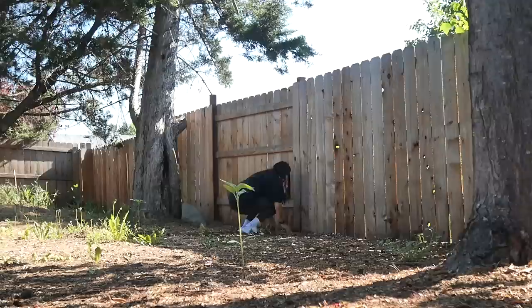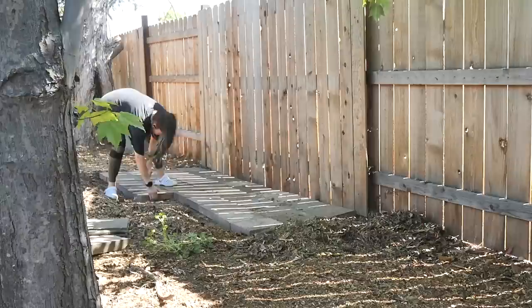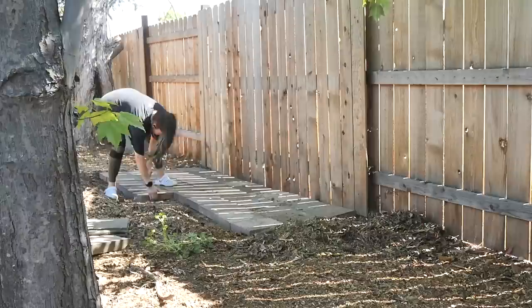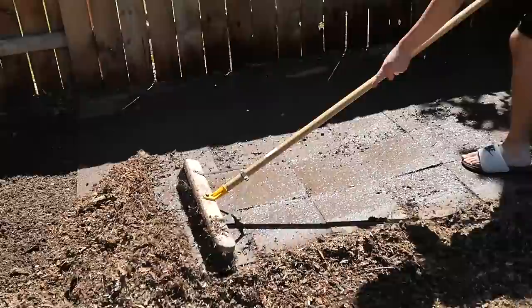I had just finished working out early in the morning and was man-handling all the tools and pavers, then went inside for breakfast. After that everybody else woke up, so I brought them outside to help a little bit — but honestly I like working by myself because I like things done my way. The pavers are all down, and I swept all of the dirt on top of the pavers, wet it, and then with a big brush went across so it fills all the cracks so they don't move too much.